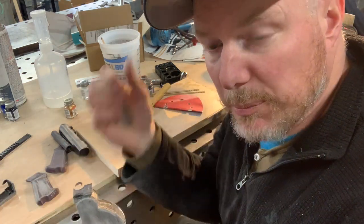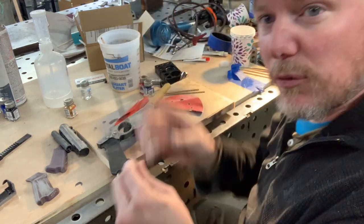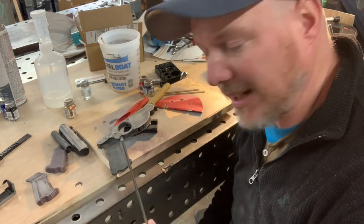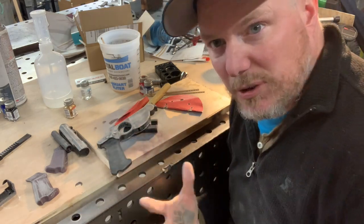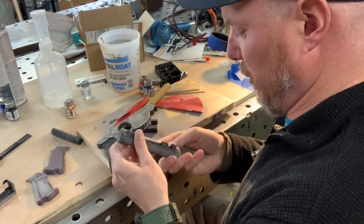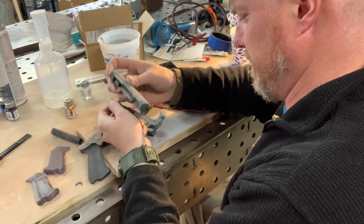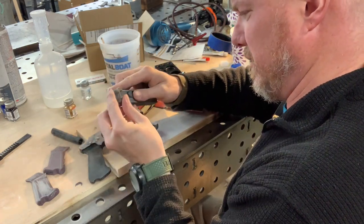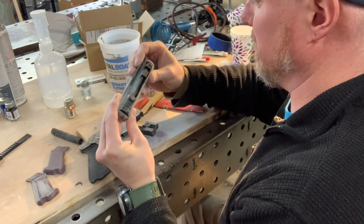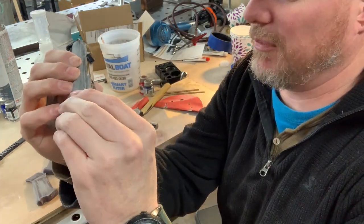If you're going to be using polyester fairing compound, I highly recommend you put a mask on while you're doing it — this stuff is pretty bad for the lungs. Where this attaches to the gun is a recipe for disaster to break, so I'm actually going to drill a hole in the bridge part and insert a piece of one-eighth inch tungsten — probably about that long — and epoxy that in to give it a little bit of strength and rigidity. I finally figured out how some of this stuff goes — this actually goes in here like this. That's actually how that sits.